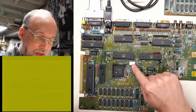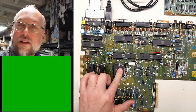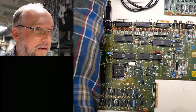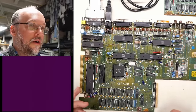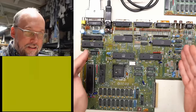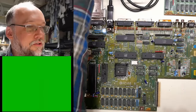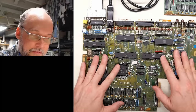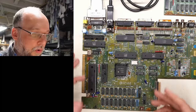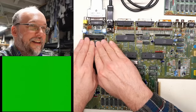I could pretty much be assured that this crystal oscillator is good. When I'm touching the board, it's changing in brightness and we're getting green flashing now. So definitely taking this thing out and trying to clean up the socket helped a little bit. These kinds of errors — like the flashing green — I need to look up what kind of Kickstart this is. We have signs of life with just cleaning the socket and putting the chip back in. Amazing. The fact that we're getting a green screen kind of implies the CPU is running, the clock is good, and the ROM is executing code.